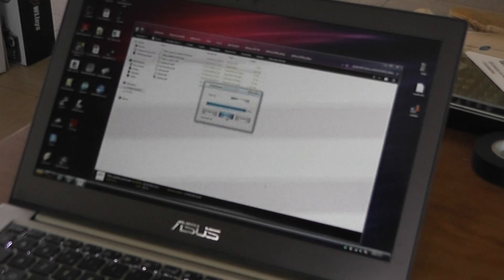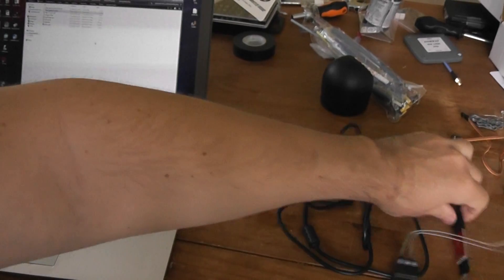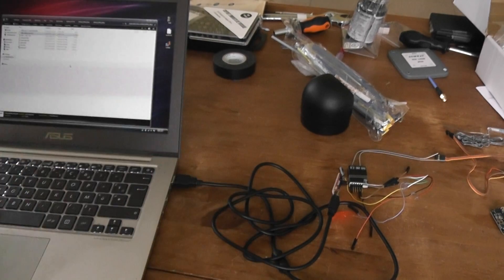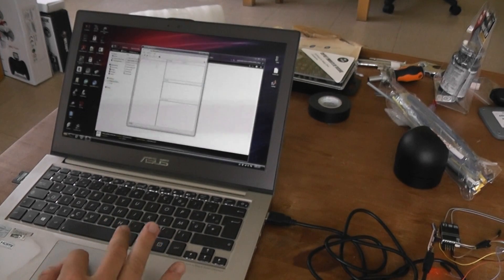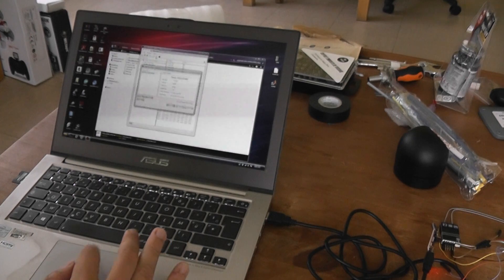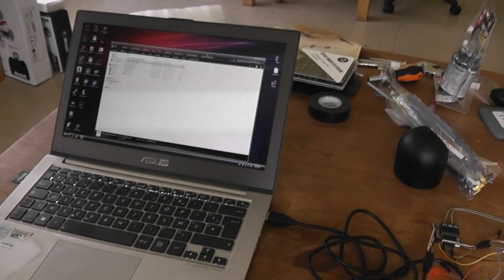Now my receiver is flashed. I will unplug my setup. Don't forget to reset your FTDI module to default, because you might forget that you inverted the RX and TX logical values. Start FTProg again, do Scan and Parse, go to Hardware Specific, Invert RS-232, and now uncheck TxD and RxD. Press Program, then click Program again. Now your FTDI module is returned to normal. This is the end of this small tutorial video. Thank you for watching. If you like it, please subscribe to my channel. Bye.